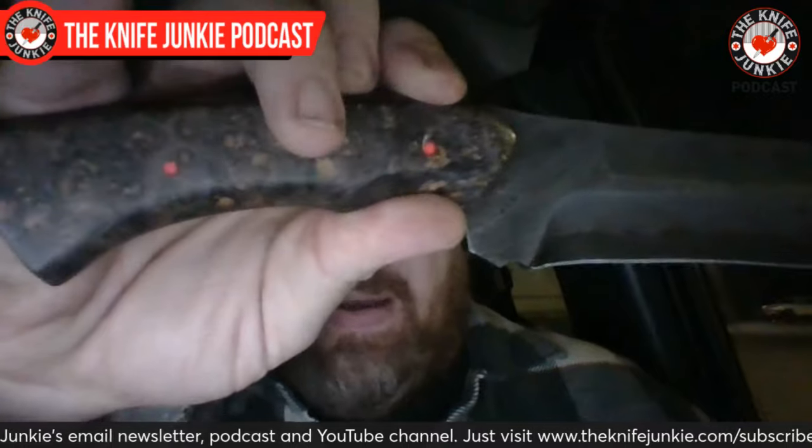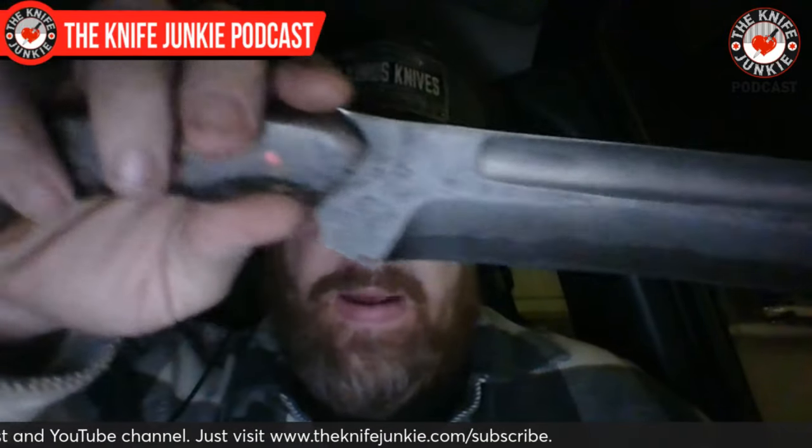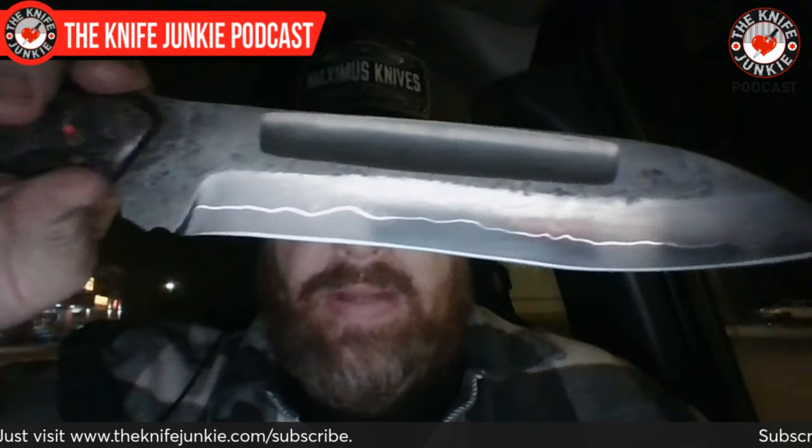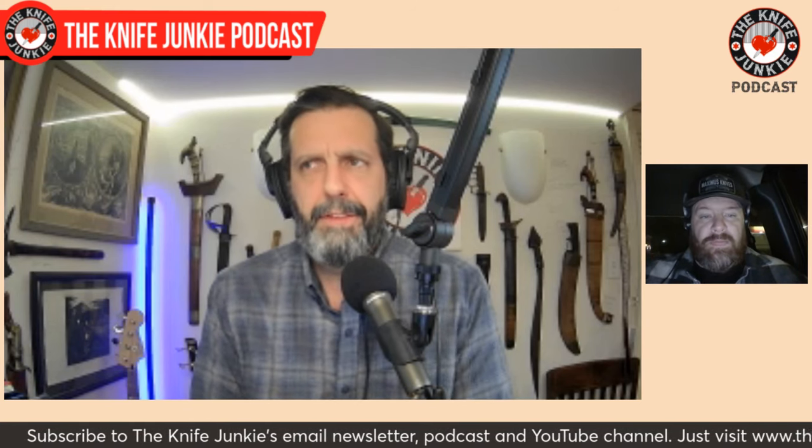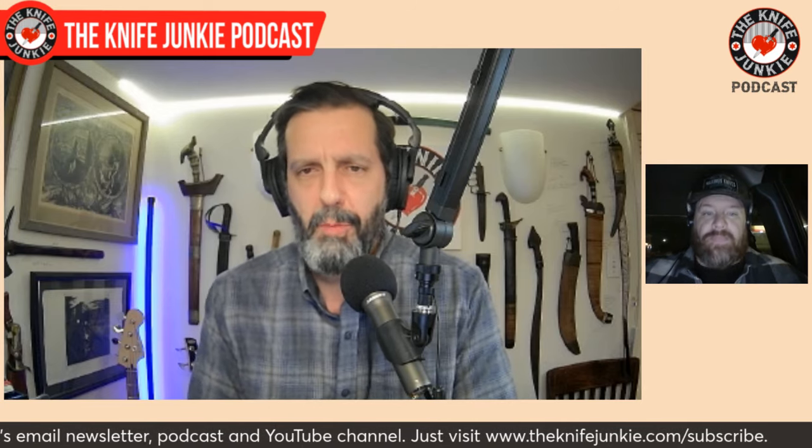And I just accidentally discovered how I achieve the polished look of the platinum line. There's a way I etched them that's actually really simple, but the hardest part is taking it up to a 2000-grit hand-sanded finish and polishing everything to a mirror polish before etching it, then doing that again and then etching it again. So you etch it, repolish it again, and then re-etch it again. Some of the stuff I saw at your table at the Texas Custom Knife Show — the culinary stuff and definitely the platinum line — are very refined in terms of surface and finish.